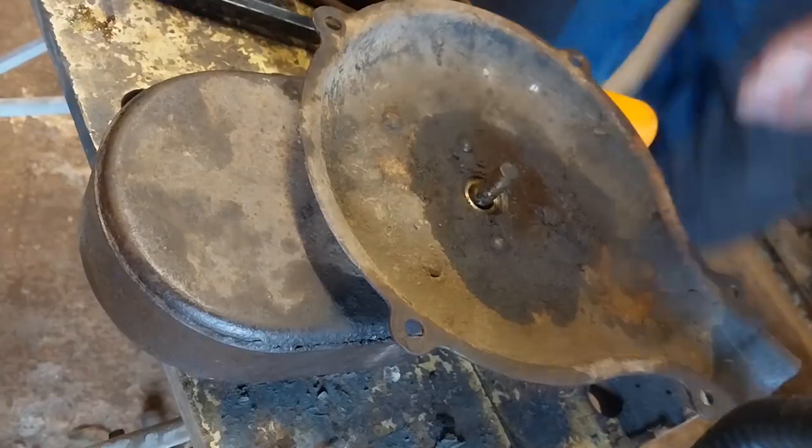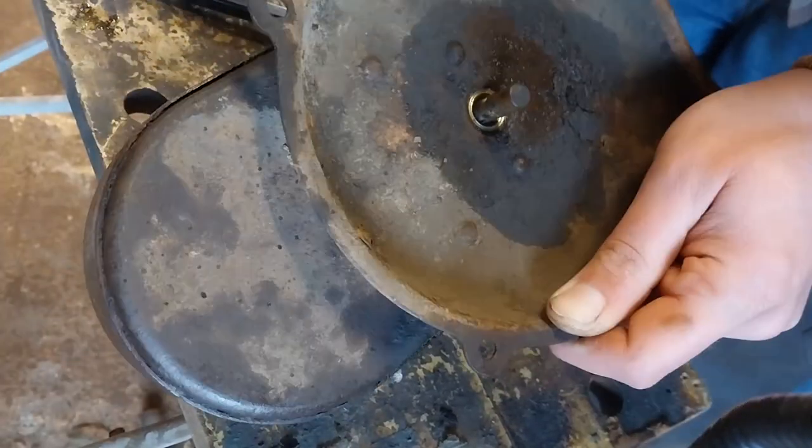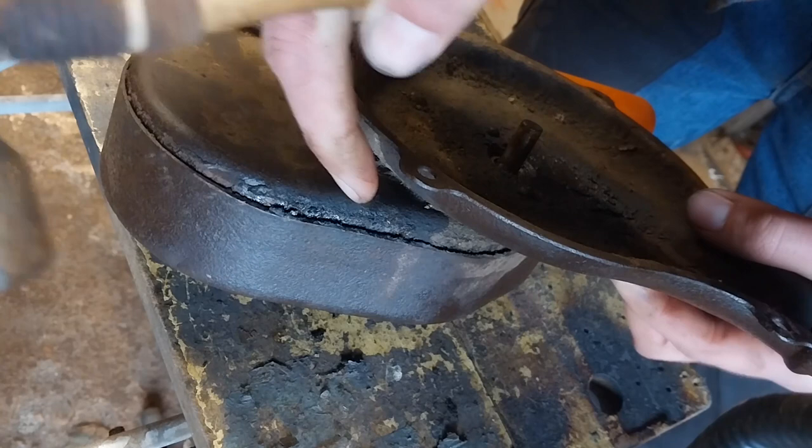Interesting. So one great way to shake off rust welds is some gentle love taps with a little hammer. Not enough to dent the metalwork, but just enough to sort of jar things loose. I'm just going to do that. I'm going to take this process slow because I don't know what's inside there. I'm not sure what might fall out, and I'm not sure if there's anything hiding from me. So a couple of love taps just to break those bonds. I'm going to try and scrape out some of that gunk and see what I can see before going too hard at this. Can already see that working there.